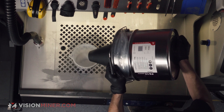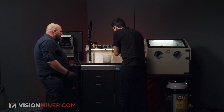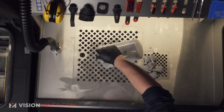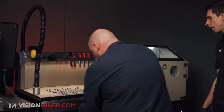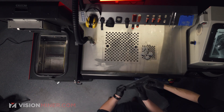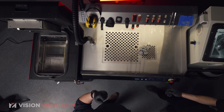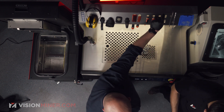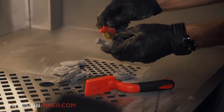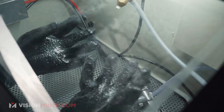A 22% refresh rate means 22% of the powder used in the next print has to be fresh — that's pretty good. A very important thing: always put the powder here in the powder collection place, not anywhere else. Now you can use this tool — it's like a spatula — and we're just scraping it all in. Now we'll be a bit like Indiana Jones and clean the parts from the powder.